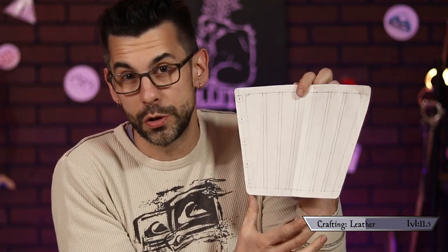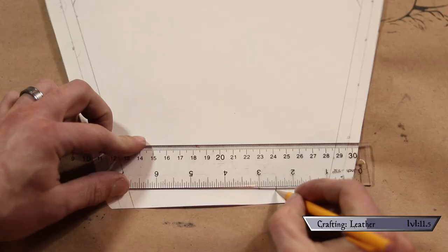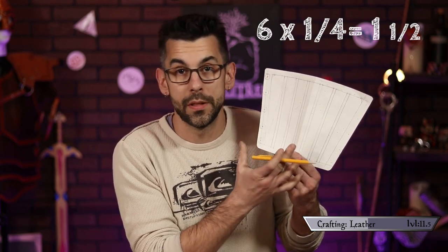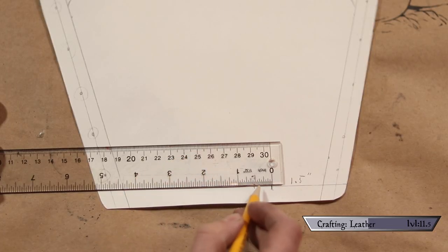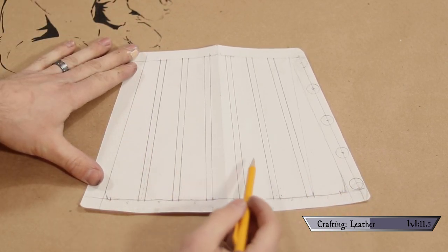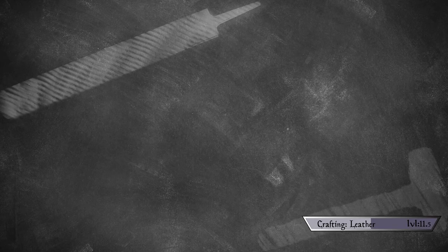As you can see, it narrows as it goes towards the bottom, which means I'm going to have to taper down each piece of metal to fit. To figure out the bottom-most measurement, I first deducted an inch and a half from that bottom space — that measurement came from adding together all six of the quarter-inch spaces between the bars, leaving four and three-eighths inches over. Because I'll be using seven pieces of metal, I divided that number by seven, leaving me with a measurement of five-eighths. I then draw on my bars with one inch at one side, five-eighths at the other, and a quarter-inch gap between each bar. With all those numbers crunched, we can move on to shaping the metal.